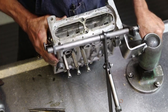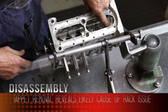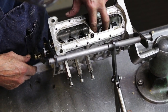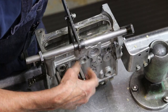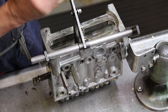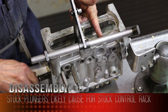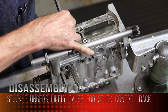You'll notice the height of this tappet being returned. Those two are shorter and not coming back as far — those are probably the two that are keeping this rack tight. The plunger is stuck. The rack hooks all six plungers together, so if one of them is tight, the rack will be tight. That keeps the governor operating on the rack, and that's what controls your delivery.